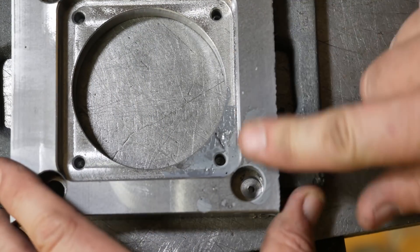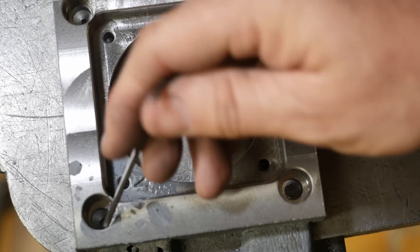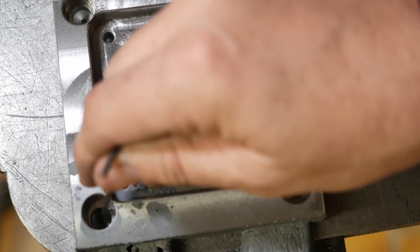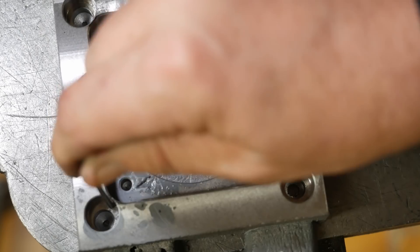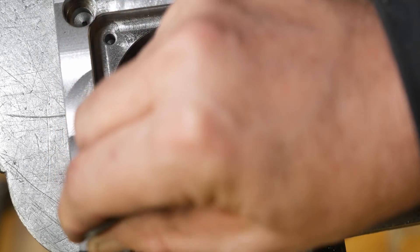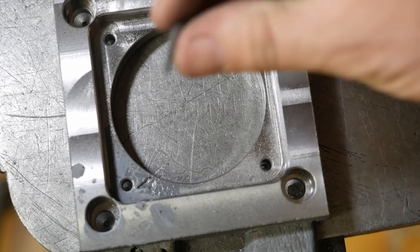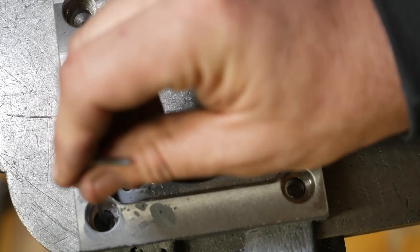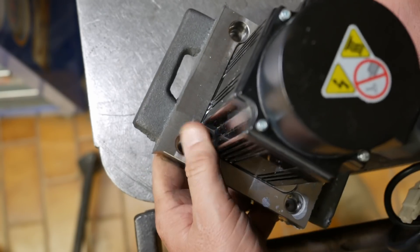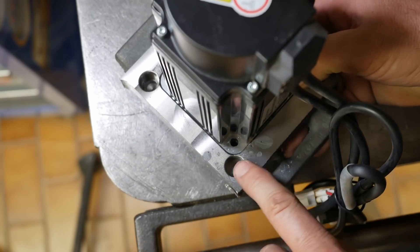I can't really say that stuff looks that metal color — it's more sort of a gray. You can see the drill deflect really badly because it obviously had metal on one side and only epoxy on the other. So that hole's well off center. When I flip it, I'll just put an end mill down to straighten up that hole from the other side. These are oversized holes for belt tensioning, so it doesn't really matter that it's lost a bit of meat there.